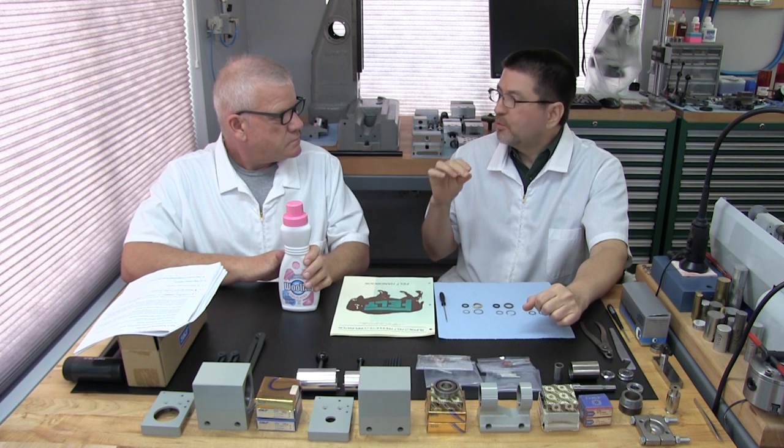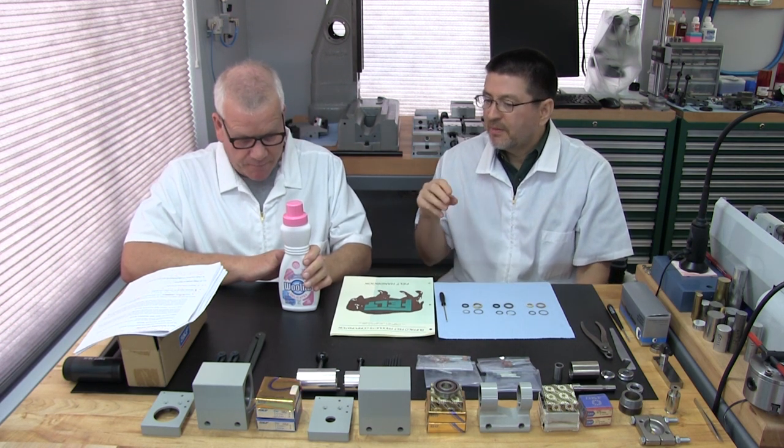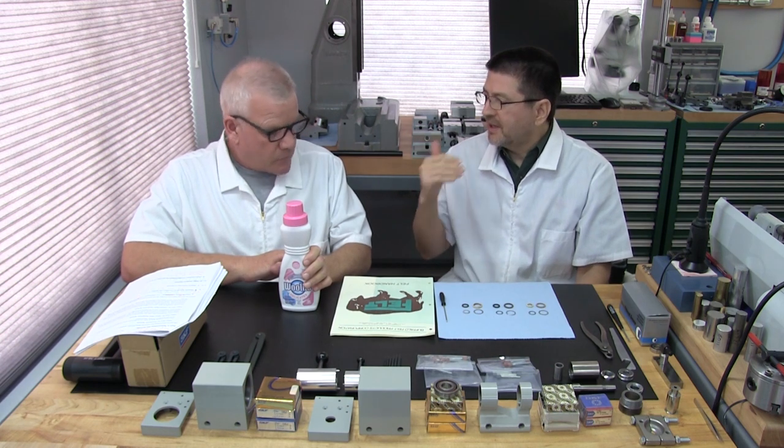And the funny thing about this is what you need to clean and not damage your wool, your felts that are made of this fine wool. Your machine spindle felts. In our case, the felt rings we use in the spindle, it's not so much about damaging the wool material itself. It's more we don't want to break up the felt because then we'll lose our nice ring, our nice form. That's why we've got to be really gentle and use gentle cleaning.